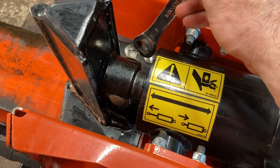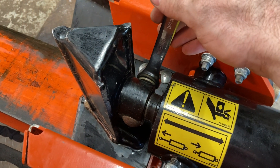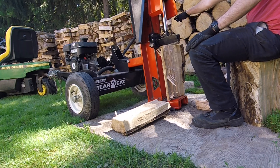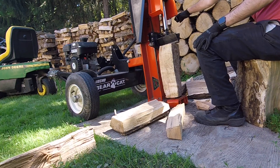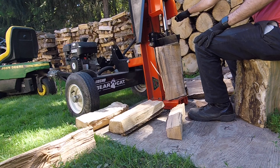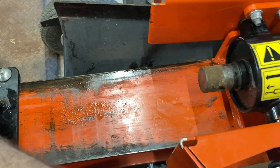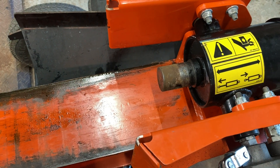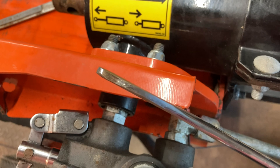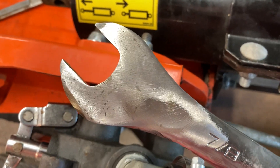Next I'm going to remove the wedge, which is a second weak link on this $2,200 splitter. It doesn't split so much as violently bifurcate rounds. I've got chunks of siding missing from my garage from this thing — don't stand next to it. To get this valve off the cylinder, you need a special slim hydraulic service wrench, or a cheap Lowe's wrench and an angle grinder. For the win.